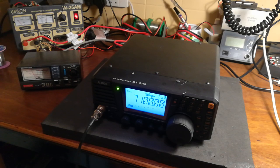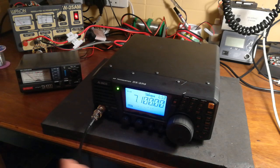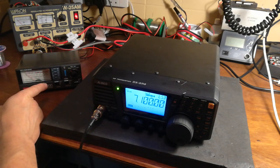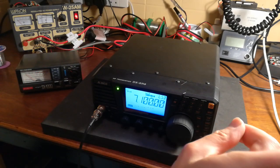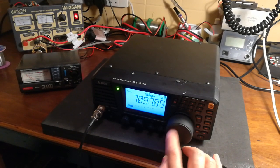That's very good power. It's not very often you get a radio which actually does 100 watts when it says it does — a lot of them are quite a bit less, most are around 80 watts or so. But this is actually around 110 watts, give or take. Obviously it's not a true PEP reading on that meter. So that's the mod.